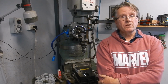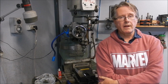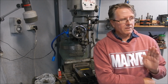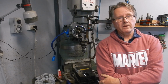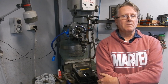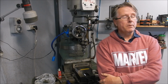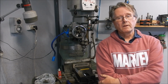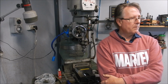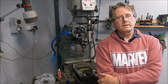The biggest one I've just finished recently is the Victor Lathe pulley drive and brake drum assembly. So we've got that all back together and the lathe is now running again. I had to do some modifications to that. There had been some gremlins at that some time before, so we've had to fix up some major alignment issues both on the belts and also on the brake band. So we've got them all sorted out. I'm very happy. The new drive's up and running, and very happy with that as well.